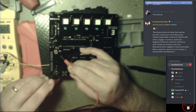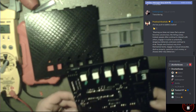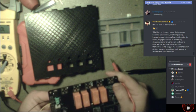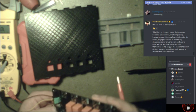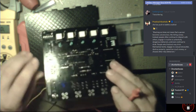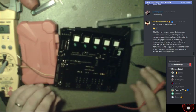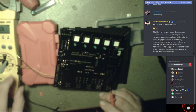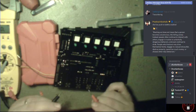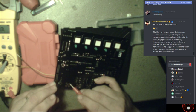Yeah, and the other thing that comes into play is power handling capabilities. When you're listening, when you're looking at a system for receiving on an antenna, you're talking about millivolts. When you're transmitting, he's pushing potentially several hundred, if not approaching 2,500 watts of power through this. Now, what he's holding is not going to handle 2,500 watts, but it might handle 100 watts.